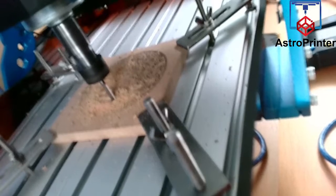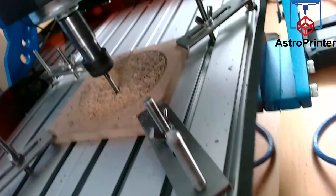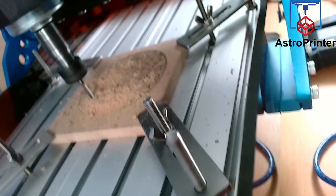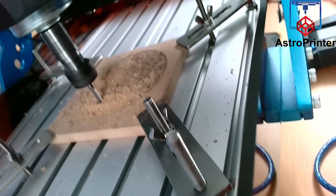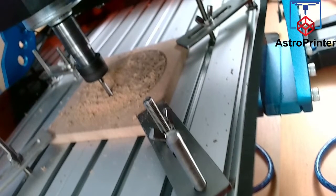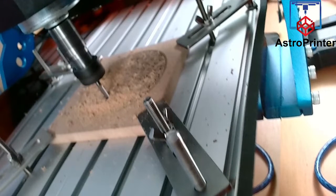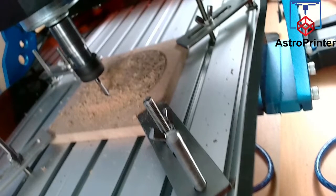So the test print I had set up for this morning is actually running now. And I can move my microphone away from the CNC so it might be easier for you to hear me. But we actually got it working. There was a connector in the back that is keyed to go together. They've wired it the wrong way around for the keying to work. So once I checked the colors of the wires, I twisted it 90 degrees and plugged it in, then it started working. So it's a QA thing they need to address on their side, but it's not a major setback.